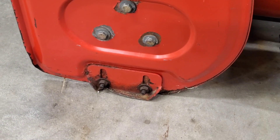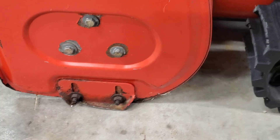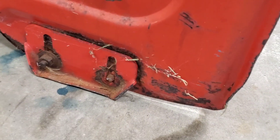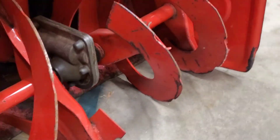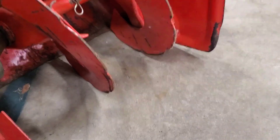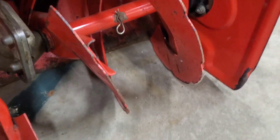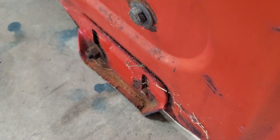One of the first things I notice are the glide shoes are dented up and worn out. They're sitting so low, and this side is damaged and missing a bolt — it's sitting so low that the auger is actually touching the ground. So we wouldn't want to even try to start it and have the auger chew up the ground or chew up the auger. The edges look like it's been started in that condition, so we're gonna clean up the edges and put on new glide blocks. I ordered some on Amazon.